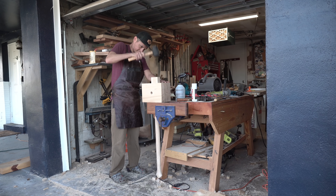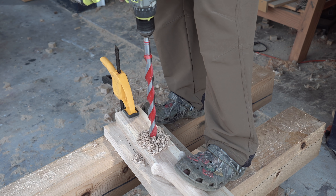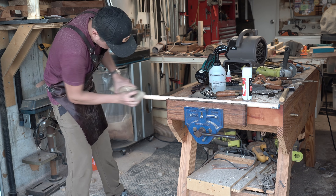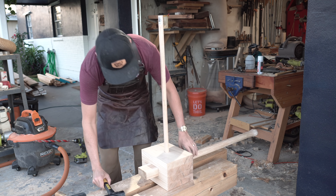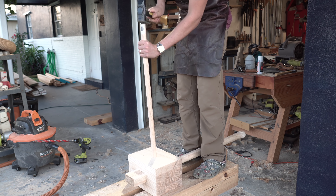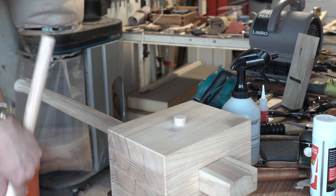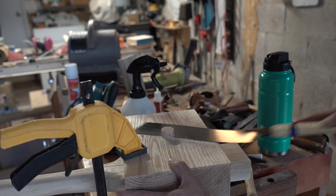For the drawbore I'm marking the center of the hole on the tenon, disassembling the mallet, and then marking toward the shoulder about 1/16th of an inch, then drilling the tenon and whittling down the end of a red oak dowel which will pin the joint and bring the mallet head tighter towards the handle. Hammering this sucker in was tough — these one inch dowels do not really want to bend — but eventually it got through. I went with a store-bought dowel from Home Depot, which was certainly faster than making my own. I trimmed the excess off with a curved multi-tool blade. I initially thought I wanted to leave the peg proud but after I stared at it for a minute decided to just flush it up, and then I cut a little bit of the excess off the top of the handle tenon.